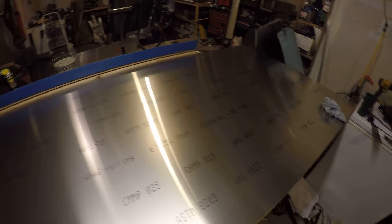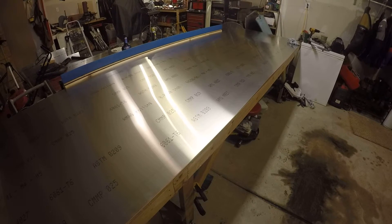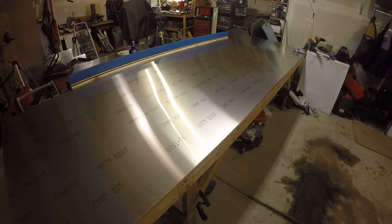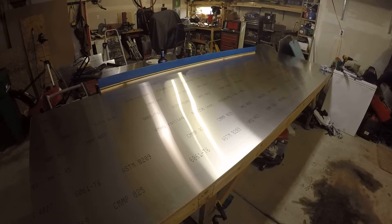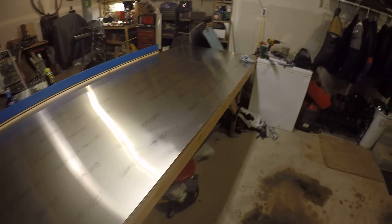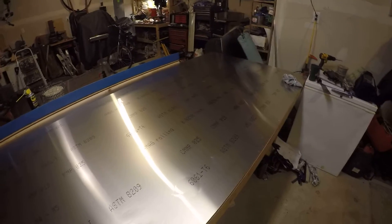Resist the temptation to roll out four or five layers of aluminum and just go to town cutting on the top layer, because invariably you'll end up punching through whatever protective means you have in place. The only exception would be if you're using a three-quarter inch piece of plywood. When I was doing my flap and aileron skins, I had forgotten I had a layer of aluminum on the table and I drilled a rivet hole through it when I intended to be drilling another structure.